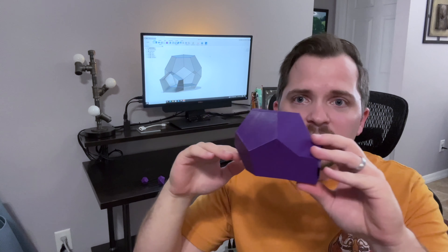Shortly after I made a discovery: in this design there just so happens to be ten identical pentagons that need to be cut out. Which is great if you're cutting things out because you can make a jig for it. But also ten is where you start getting price breaks when you have laser cutting done on materials. So you see where I'm going with this — this design was meant to be a laser cut metal cat igloo. I exported the five unique shapes in this design to my favorite laser cutting service and ordered all the parts necessary in one-eighth inch aluminum sheet plate.